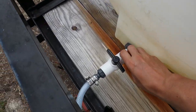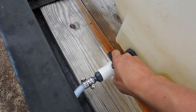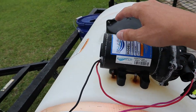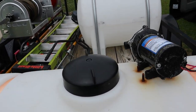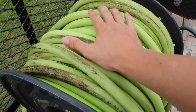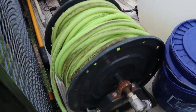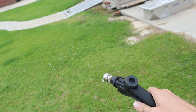You'll have a bulkhead fitting right here, which will come out to a half-inch ball valve, which will come to a half-inch line going right to your five and a half gallon-per-minute pump. When your pump is hooked up, you'll need to hook up a fitting out here to come outward to a soft wash hose onto a hose reel. This hose is about 250 feet, which goes to my soft wash gun here — works perfectly fine.